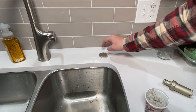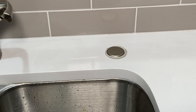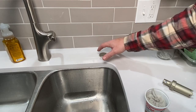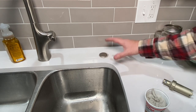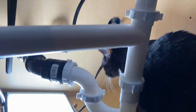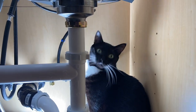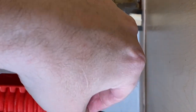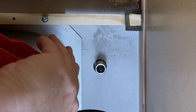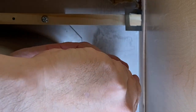The moral of this story — you just pop this cap in here, give it a nice push down as far as you can, then go below and tighten it up. Make sure the hole in the countertop is the same size as the faucet, which is an inch and three-eighths. You can really just take this, stick it on there, and it's going to stay in place.